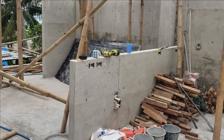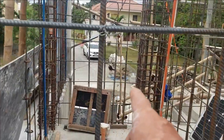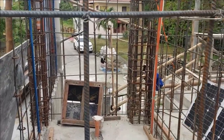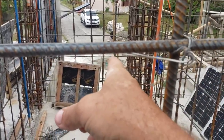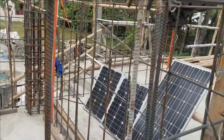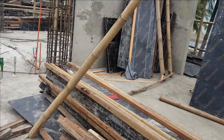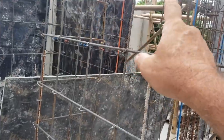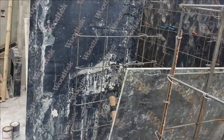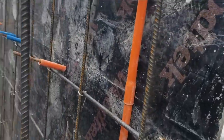Well, I have everybody working on the rooms down below. Like Marlon, he's out here sifting sand right now for them to render with. Guys are mixing up mortar. Actually, what they're using for rendering out there in the street right now, covering those hollow blocks down below. Joel's helping them out on that down there right now. I've got Joel cutting strips to make some door bucks for 3 doors right here. And me, I'm up here putting up this plywood and all on the forms.